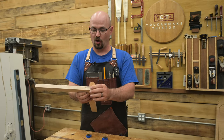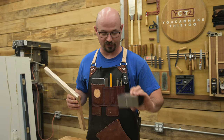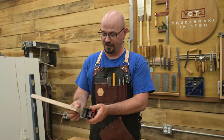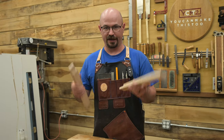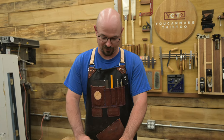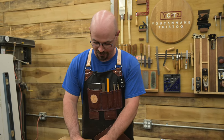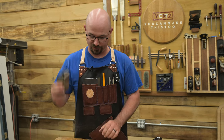You can even tell I went a little long. So once I glued this up, instead of using a shoulder plane, I could use something like the 105 — the one-handed plane — to even plane the ends of the boards to bring them in perfectly flush. And even if you're not necessarily doing joinery, let's say you were doing pocket holes or something, and the boards aren't perfectly milled and you have a little bit of a lip — it's really easy to come in with a hand plane afterwards and smooth things up.